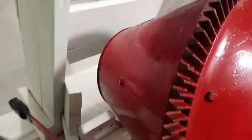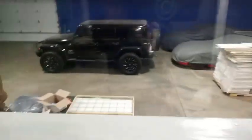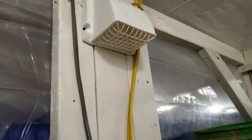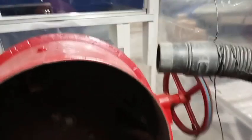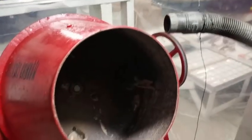Here is when the mixer is dumping into that chamber. We had to design as we went — this is a boxed-out area so my hand can get in there for this lever. We had a custom make so the drum clears nice and tight. We put glass windows in here so we can see down there what's going on. It gets pretty tight in here — this hose sucks air, that flap opens up, and I get an airflow going across this drum. When I dump that Portland in here, any puff of dust I'm going to catch with that air vac system. We have our ramp here that services the sand and gravel bins.